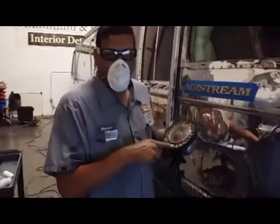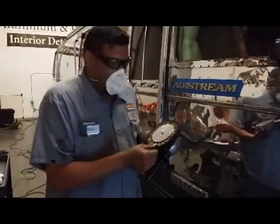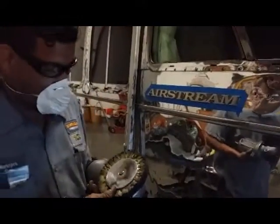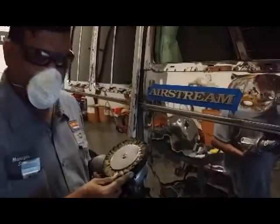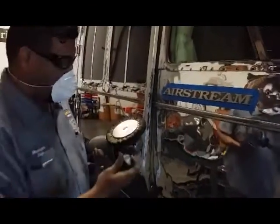we're gonna go with the airway, a used up airway, so it's small, real dense and stiff. Because if it's larger, it's going to want to grab the edges. It's going to want to pull you in all kinds of directions. You're going to be fighting. So it's real stiff. It's still got the cut and coloring power. And then we're going to use a green chromium stainless steel blue bar, green bar. Okay?